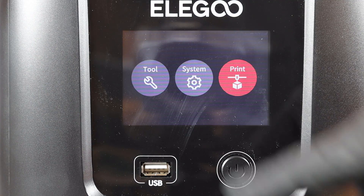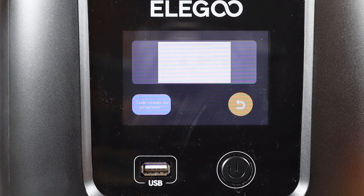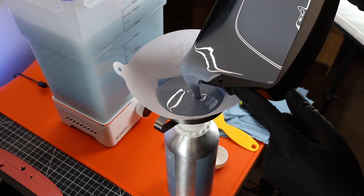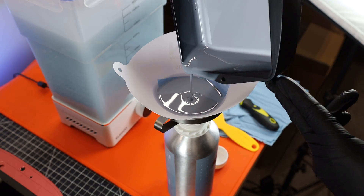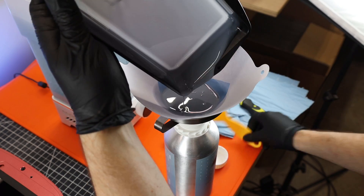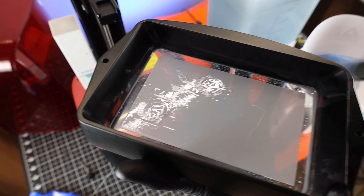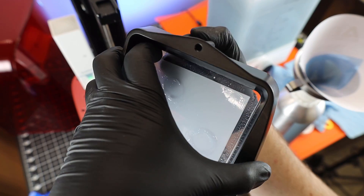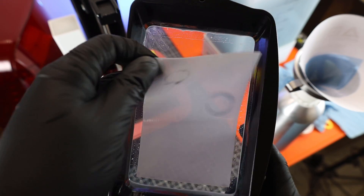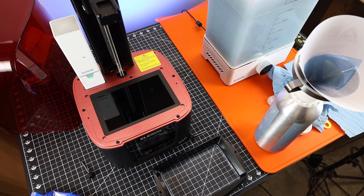Before just trying to print again, I need to clean out my vat seeing I had a failure. In the display I'm going to go to the tank cleaning option and turn it on for 15 seconds. Once that's done, I'm going to pour all the resin back into its bottle through a paint strainer — this way if there are any little pieces floating around, I can catch them before they go back in the bottle. With most of the resin out of the vat, you can get the residual resin out using a plastic scraper. You can see where the failed prints got stuck to the FEP sheet, and curing it all together makes it a lot easier to remove. All I need to do is run my knuckle across the back of the sheet and it will just peel off — much easier than trying to deal with each little piece on its own. If you had a failed print and didn't do any of this before printing again, you're most likely going to crack your screen.